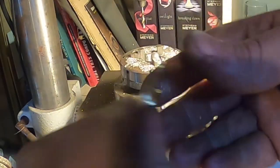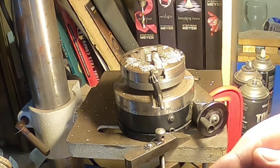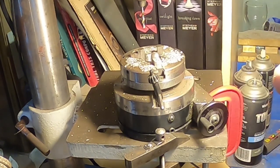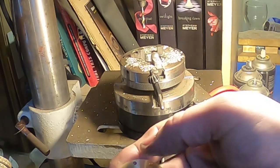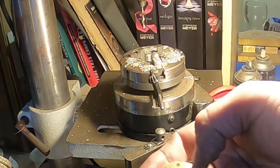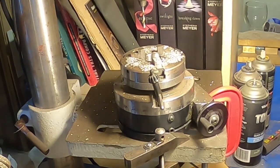We've got the bolts on the PCD, so that's pretty cool. Two ways we can go from here. We can set the other part of the pump up in there and put the 10 holes in. But first we want to mark one, because these need to line up. There's a pipe goes through between these, so that's fairly important. So I'm going to mark one first.